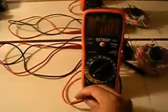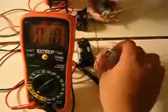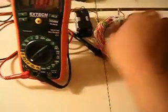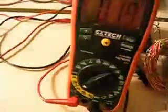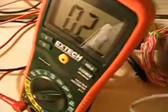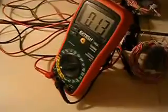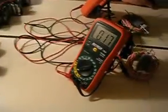So back to the 20 amp DC setting. We're going to put this here and press. I need to make sure I got this right — it needs a little bit of help. So this is the amps — actually the point-something amps. Right now I'm using 0.20 or 0.17 amps at 4 volts. So let's say 0.2 amps times 4 volts — that's 0.8 watts.